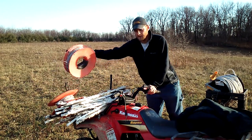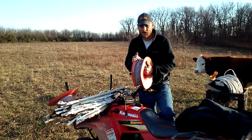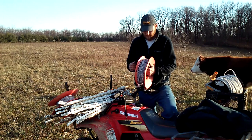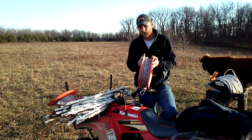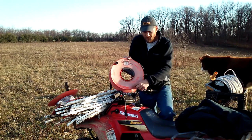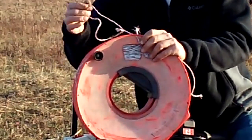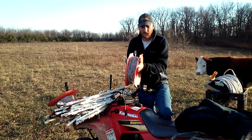Let's talk about the polywire reel. This isn't an actual polywire reel — it's actually an extension cord reel. You can buy these for about $8, whereas an actual one-to-one crank polywire reel runs about $25. These are cheap and a lot more efficient to get started with for intensive grazing. What you'll want to do is drill a few holes around the outside of the reel and cut notches back to the hole — that gives you a place to lock your wire in so it won't unreel. It's just a basic extension cord winder, nothing fancy, but they do hold a lot of polywire.